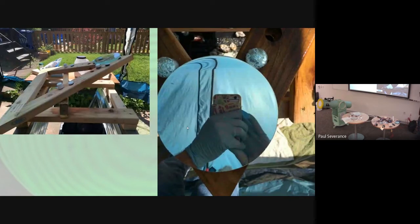Do it in the open air, and you don't need dangerous hot nitric acid, stuff like that. And so that's near being coated. And most of the time, it isn't clean. That takes a long time. If you don't clean it properly, it doesn't come out nicely. But if you do clean it properly, and you've got the chemicals in good shape, just spray it on, and you can just see it becoming perfectly silver and reflective.